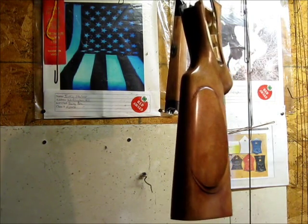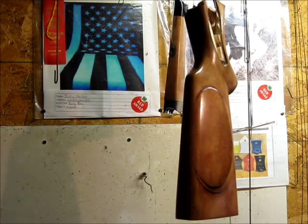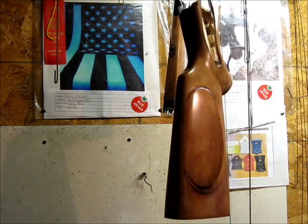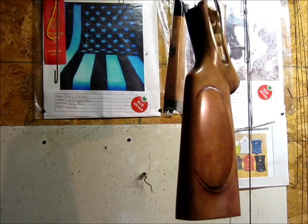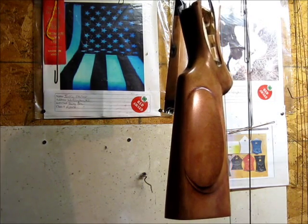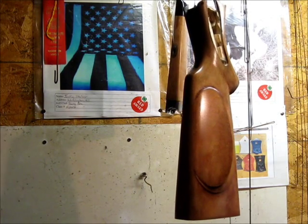And so every coat is put on, one coat every day or day and a half, 2 days, whatever it takes to dry, and the coats are just rubbed in after that initial base coat. So that's how it's done, and that's how it's filled in: a heavy first coat that's basically wet sanded back with a really fine polishing pad, and after that it's just hand rubbed coats. Takes somewhere between 6 and 12 coats to get a really deep finish going, and it just takes time. If you're taking a day and a half, 2 days between coats to dry, then it's going to take 15-20 days to get the coats built up until you get that really deep finish going. But that's how it's done.